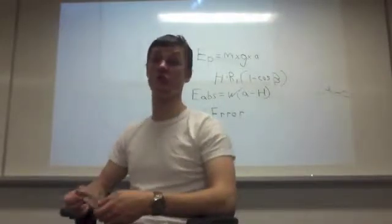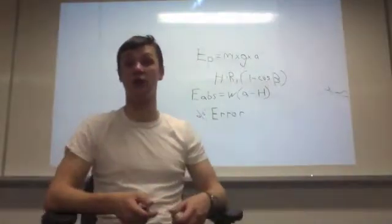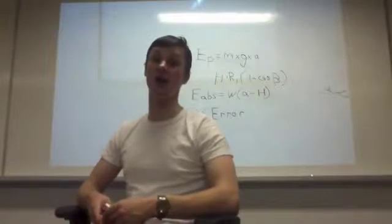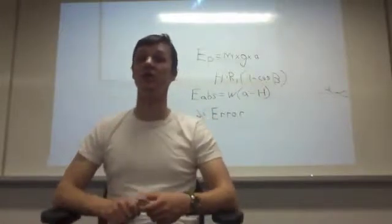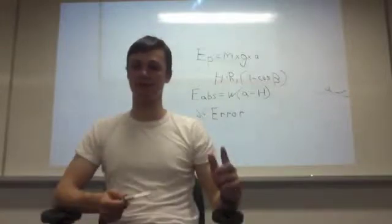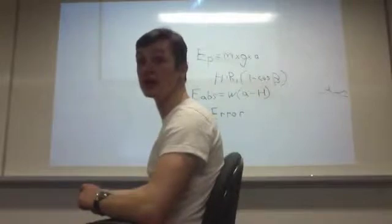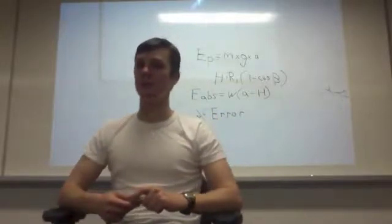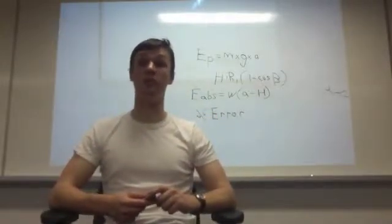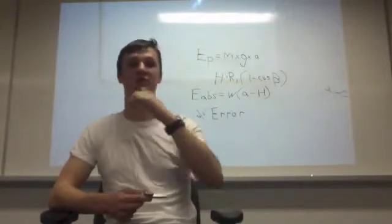First equation was for potential energy, which is equal to the mass, which is 12.0 kilograms, times the gravitational constant, 9.81, times the initial height of A, which was equal to 573 millimeters. The height after impact was figured out through the radius times 1 minus cos beta. Beta was the angle at which we measured the pendulum swinging past after impact.